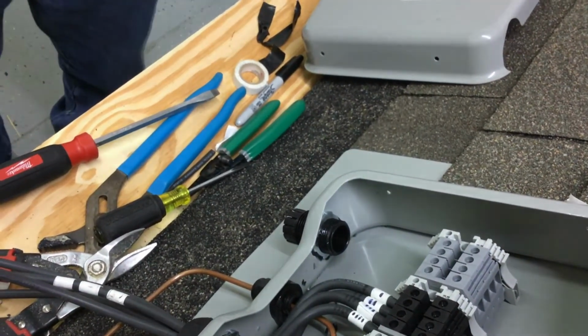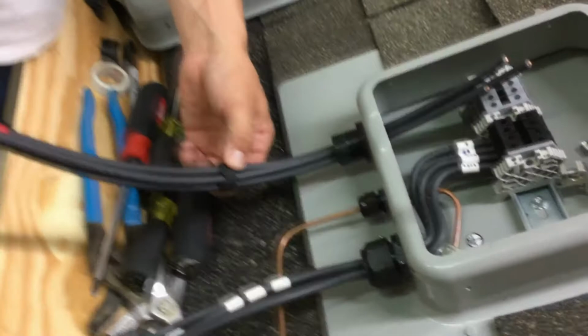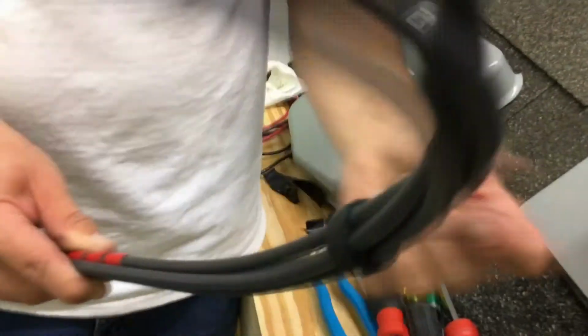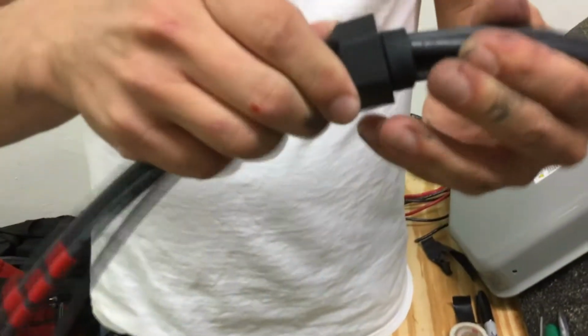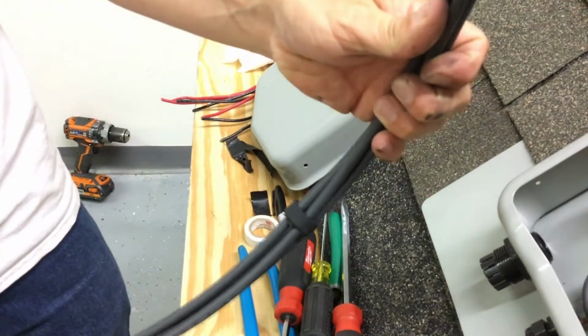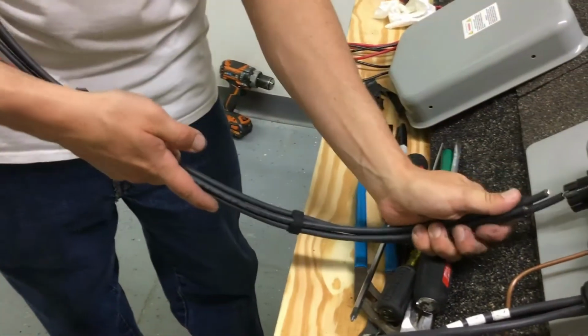That's why. Caught it. So, when I tried to put these wires in, the grommet was put on backwards. You want the part with the holes in it to go into the connector, and the tapered end has to fit into the tapered end of the connector. This ensures a weather-tight seal. So as you can see, we have 1 and 2 on the bottom, 3 and 4 on top. So we'll go ahead and push those back in.